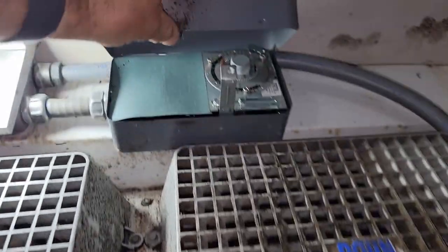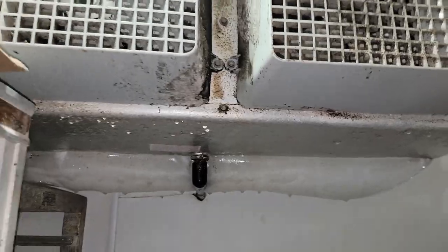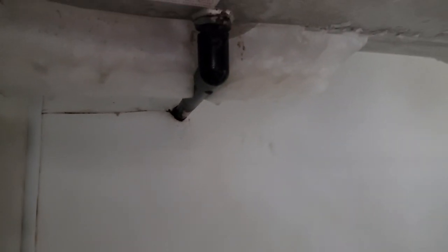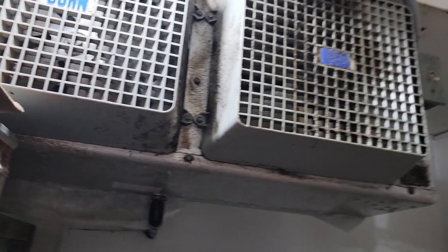Yeah, we're going to need a little while here. I think we're low on charge — that's our biggest issue. The clock is running; it's set for a 60-minute defrost. There's no reason three defrosts for an hour would not keep that thing clean, so I'm going to try to knock off what I can and then melt the rest — that's about the only thing you can do. Come at it from here and make it pop off the back, then work the back side more gently. Normally I would not do this if it were a new coil, but sometimes you gotta do what you gotta do — he's worried about some of his products getting spoiled.